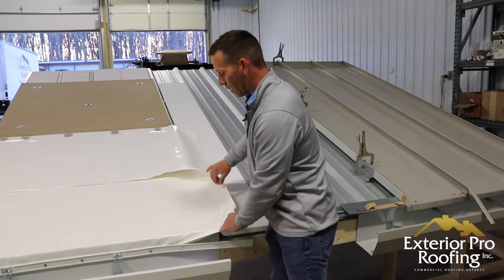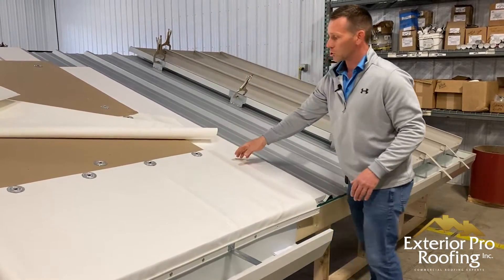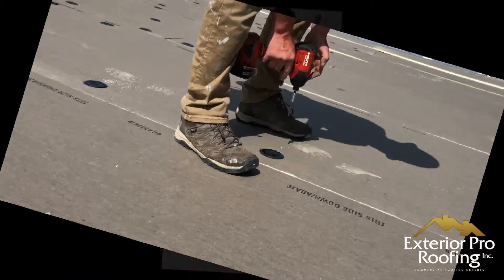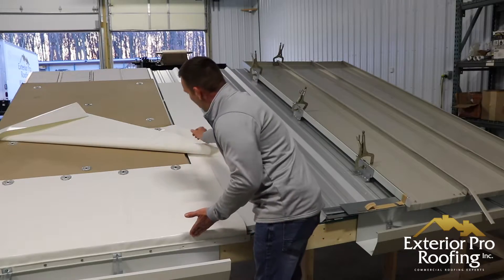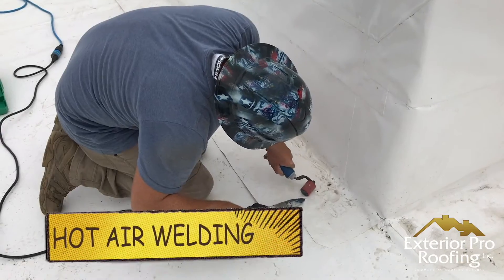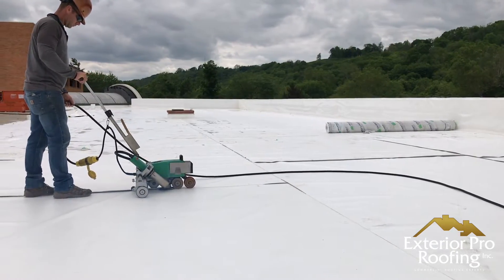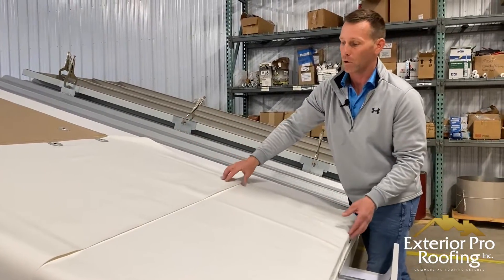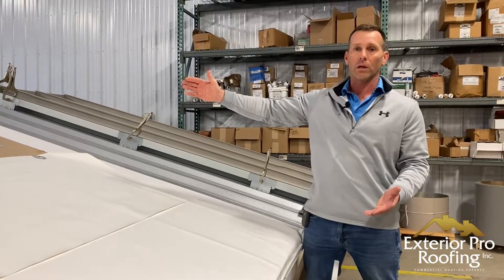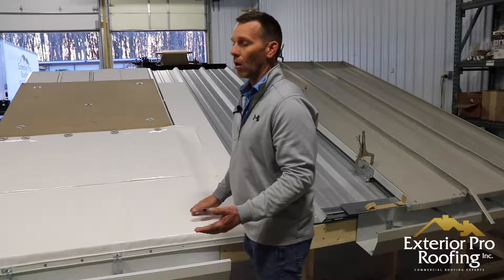After the surface of your existing metal roof is flattened out, we're going to take the membrane and screw it down in rolls straight through the membrane, through the insulation, and into the metal roofing. Then we take another roll of membrane, lay it over the top of the line of fasteners, and hot air weld it — sealing off the line of screws. You use a heat gun, a hot air welder, to weld this down and make a seam. The screws end up underneath the seam of the next sheet. This continues all the way to the ridge and over to the other side — a very effective way to stop leaks permanently.